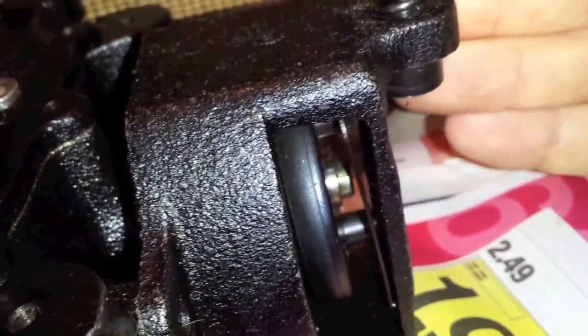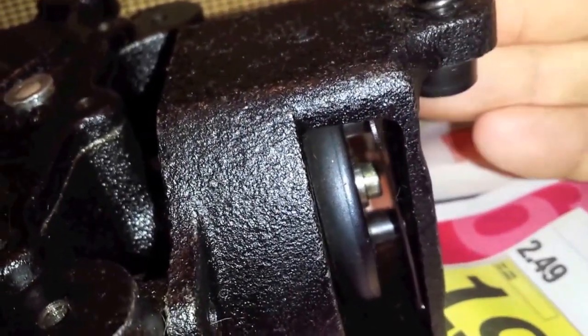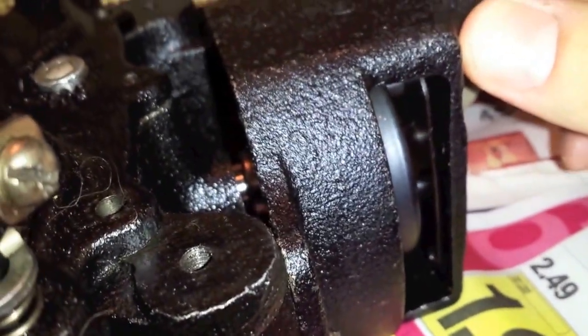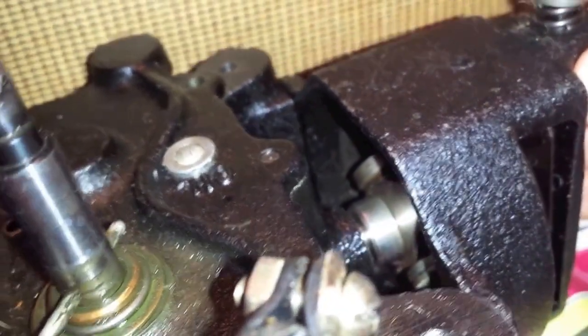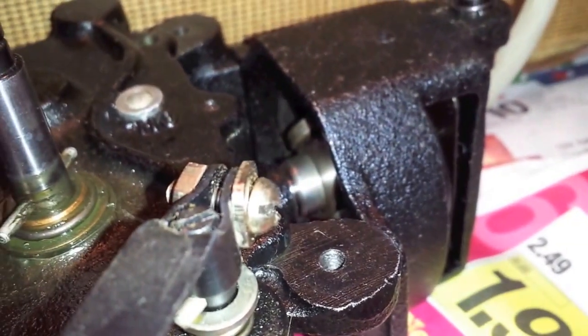That pressure plate can be controlled with this lever right here, driven by a cam. You can see it moving as I turn it — it presses out, just like that. This controls the speed. What's cool is that the motor is not speed-controlled itself; the centripetally controlled braking system won't allow the main drive shaft to turn faster than what's necessary.